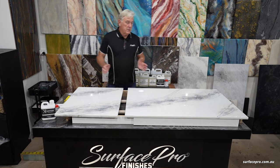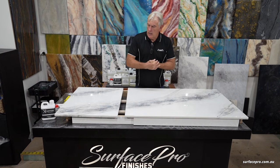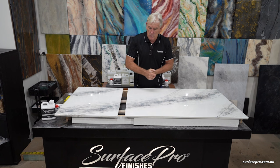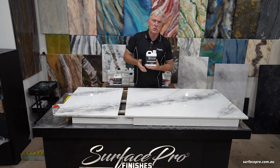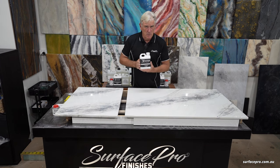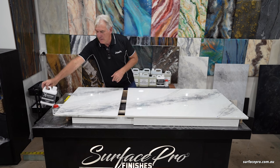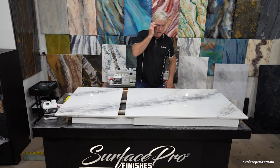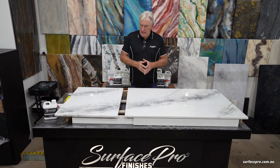Okay. So I'm just about ready to mix up the X-Factor. It's a 10-to-1, as I said, mixing ratio. One container of X-Factor will cover 10 square meters of countertop, about 100 square feet. So you could do two large kitchens with it. So there's plenty there to cover what you need to cover. Okay, so I'm gonna get this mixed up and apply it and show you exactly again how we do it. It's gonna look fantastic. Stick with me.